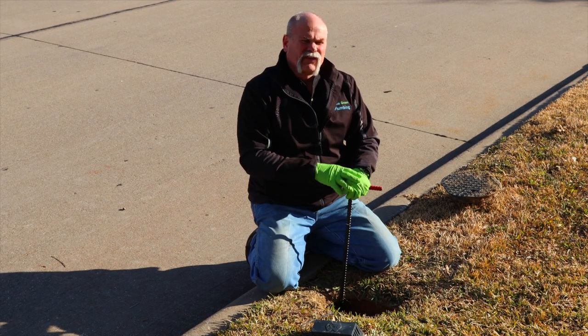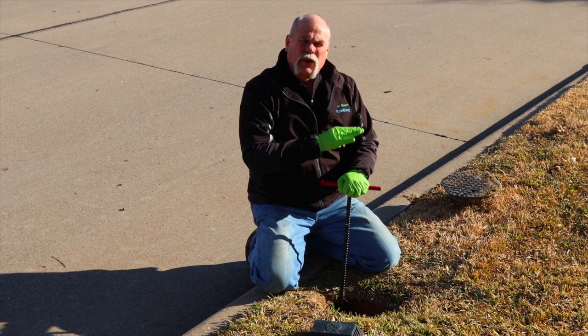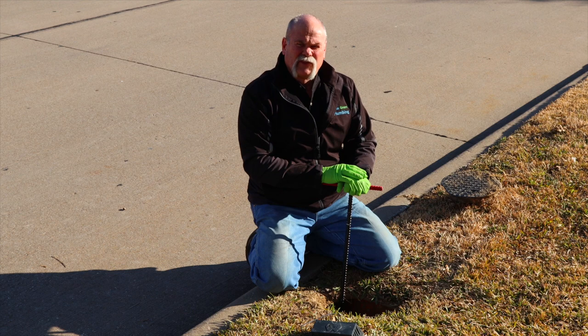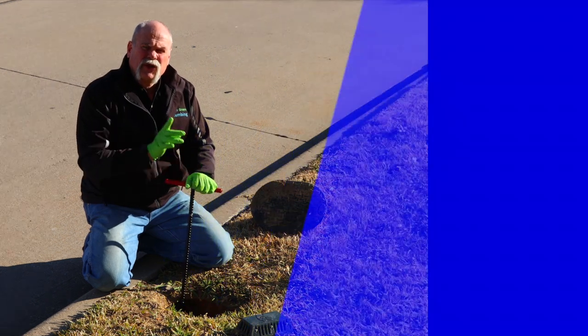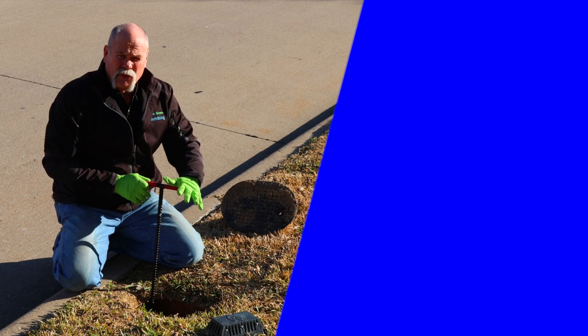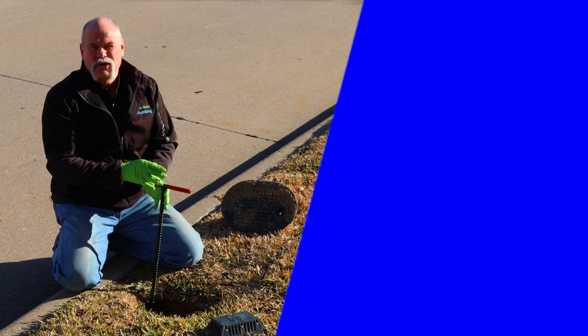A sewer and water test begins right here: we start with the sewer by filling it up, put a gauge on the house, turn the water off, and watch everything for 30 minutes to make sure there are no leaks under the slab. We recommend this for every buyer you represent, because slab leaks can be some of the most expensive plumbing repairs there are. I know certain real estate companies frown on a hydrostatic test, but there's nothing wrong with a sewer water test — it cannot damage anything under the house, and that's why we recommend it. And we're going to remember to turn the water back on before we leave. Have a great day, and I'll see you on the next video if you don't get flushed.